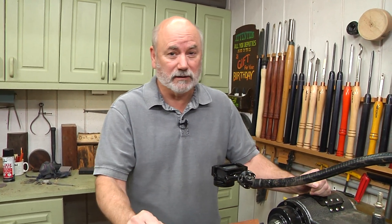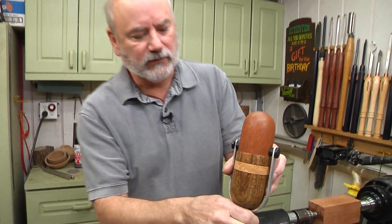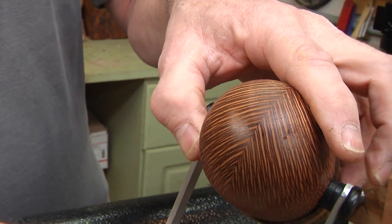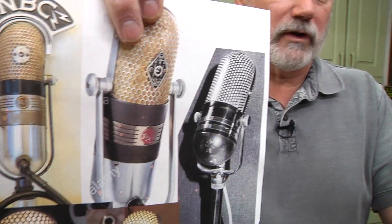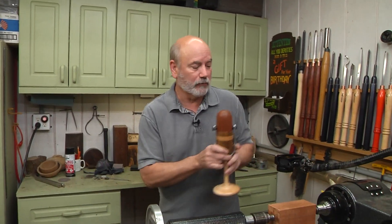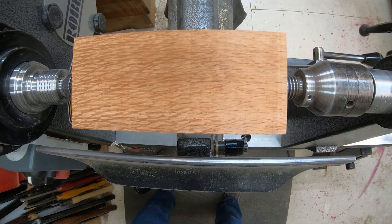The first thing I'm going to turn is a piece of lacewood. Lacewood can be several varieties of wood, but what it is is quarter-sawn — instead of going with the grain you go quarter-wise with it. What it does is reveal a really cool pattern among the hard and soft parts of the grain. As you turn it around you see the patterns, and it has a chatoyance to it. I wanted to use it because the original microphone has all these little holes in the screen. There's no way I was going to drill 340 holes, so this was the next best thing. My wife suggested using a banksia pod, which would have been a great idea, but I couldn't find one fat enough.